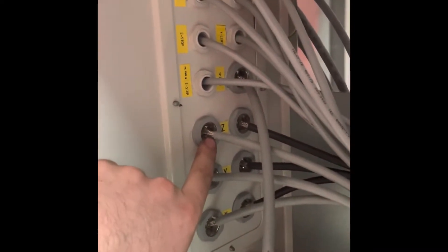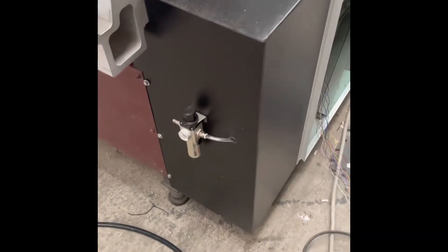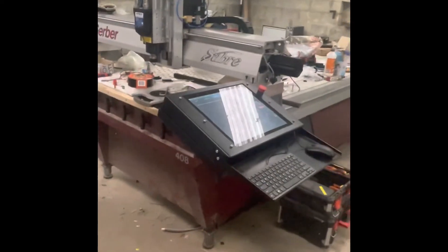All the wiring runs out through here. With these systems we use a shielded grommet. You can see there are actually little fingers in the grommet that touch off the shield of the cable — it's a very good way of shielding the cables. We've also got our air input there. That's just a little update on how the machine is going. It should be ready in about a week's time and I'll give you another update when it's ready.